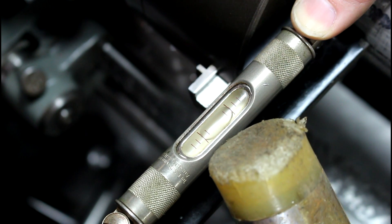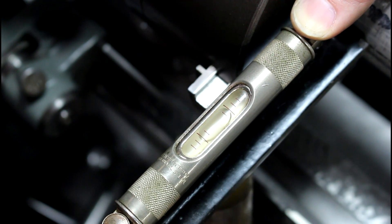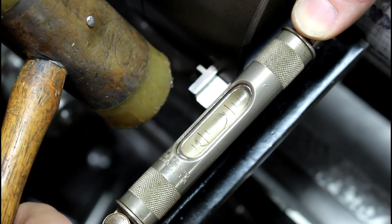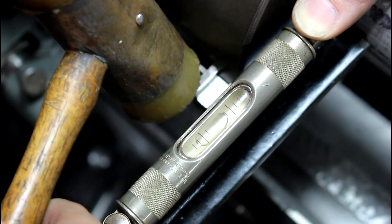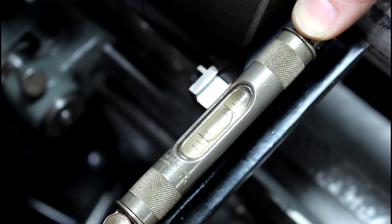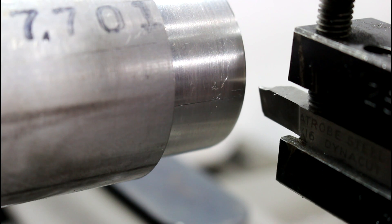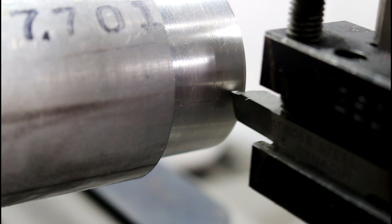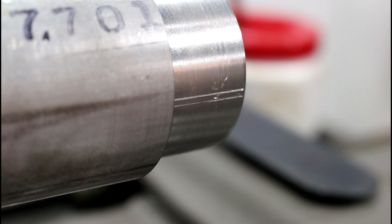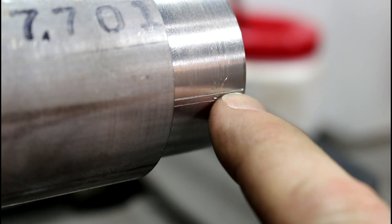And right there I'm perfectly level. So here's our level — as you can see, I'm pretty much dead on level. If you're not and you want to adjust it a little bit, just take your hammer — this is a poly-ended hammer so it's not going to bang anything; a rawhide or brass hammer would work too — and just tiny, tiny little taps to move the bubble. So there we're level, and we know our first mark is going to be referenced off of here. We just come in, make sure our scribe is in place, and drag it across. That top line is now our first mark.